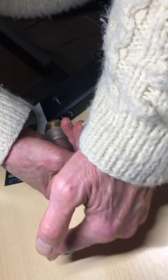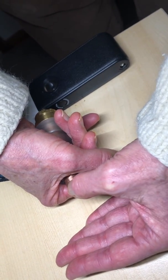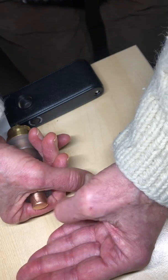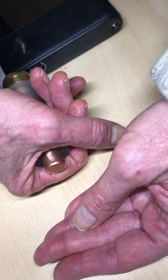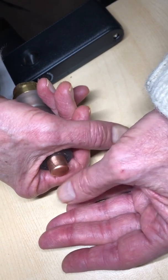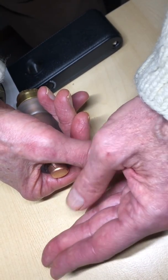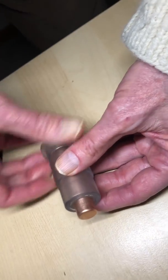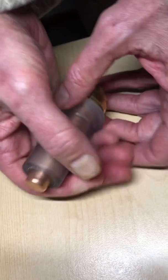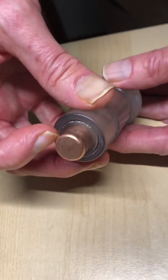The problem with such switches is that once the charge starts to appear on here, there's a possibility of the charge jumping horizontally before it jumps the intended way. That becomes a misfire, because this electrode then loses its negative charge, and therefore the switch either doesn't fire at all or fires much lighter. The insulator's job is to prevent the spark jumping across.